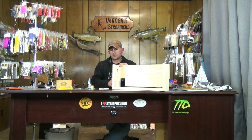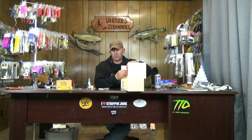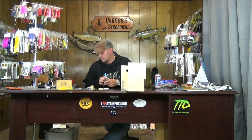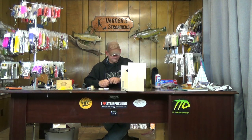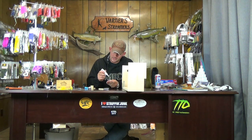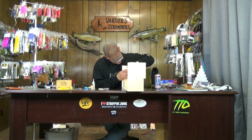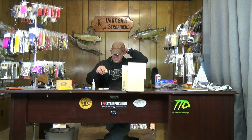I'm going to put this bearing section into the recessed portion I drilled right here. I can still get some glue out of this — I'm just going to take a little bit of gorilla glue and put a bead right around this bearing before I put it in. Then I'll just push that into the recessed hole and it's going to sit just how I want it.